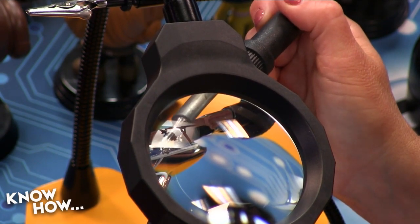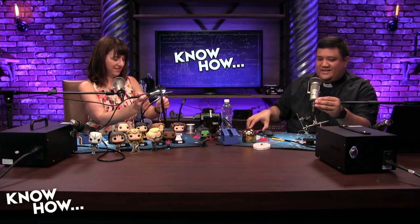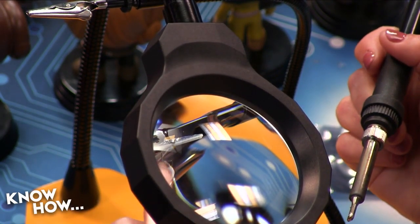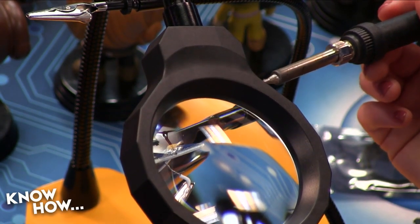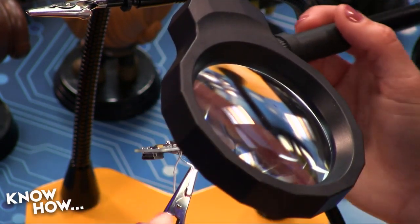Luckily, I always bring wire. Uh-oh. I have more stripped wire underneath. You want the insulation to go all the way up because otherwise, if the wire moves around, you might short with something. So I didn't do that. Now what do I do? You can heat it up and then just push it through. When you heat it up, the solder becomes like a fluid, so you can push a little bit more and get it back in there. Does that make sense? Kind of, a little bit. No, not at all.